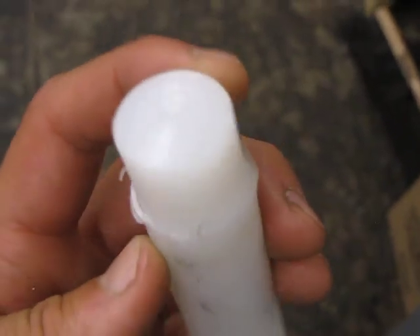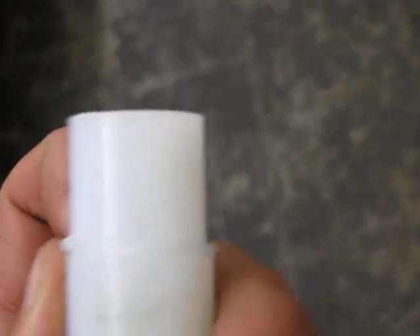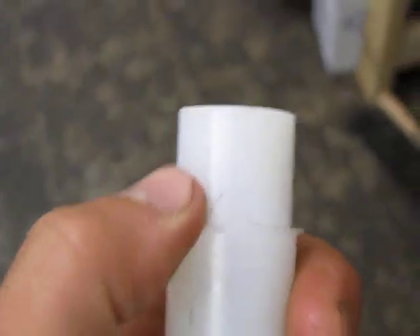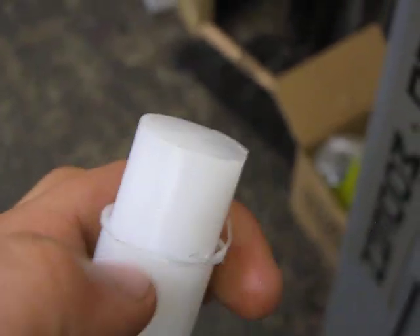The end result's definitely not as smooth. It's hard to get the surface comparison because of its color and everything, but you can even tell how ragged the edges are compared to the other piece. Very, very easy to machine the Delrin compared to the UHMW. It just gums up and it's not neat to thread or do anything with. Anyway, that's all for now.